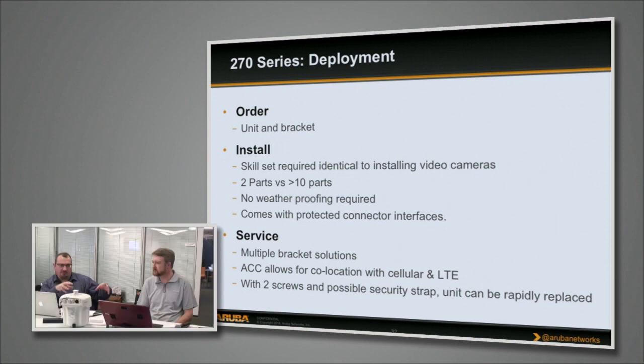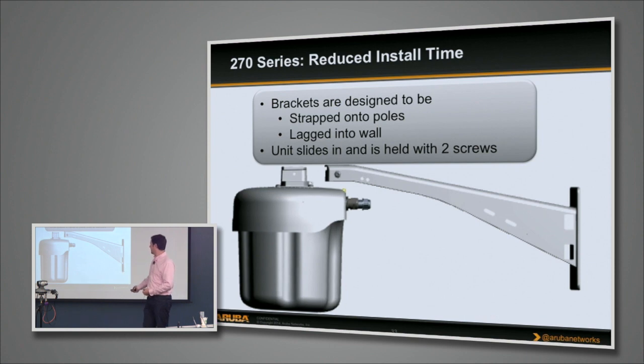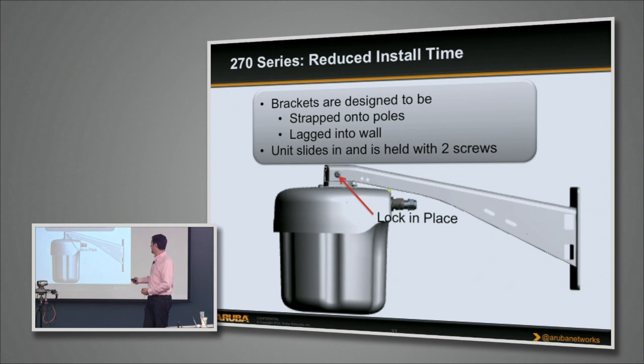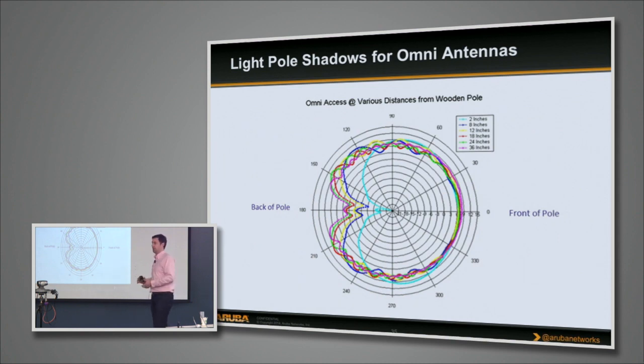There is provision for articulation. To mount it you literally just slide it in and attach a screw. This is an 18-inch mount — we also have some smaller mounts including an 8-inch mount for the side of a building. The reason we have two mounts is the larger mount gives us less shadow from the light pole. We found that 18 inches gave us the best coverage pattern from an omni antenna without giving us a big shadow behind it. There's also a bracket for horizontal mounting — if you're putting it on a stoplight, you can hang it down and that horizontal bracket has the ability to tilt and adjust the angle.